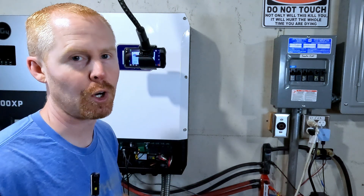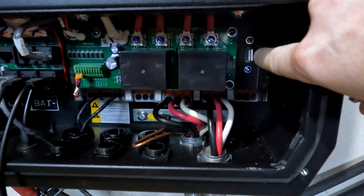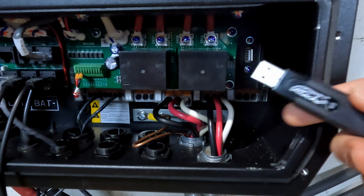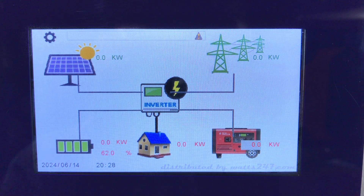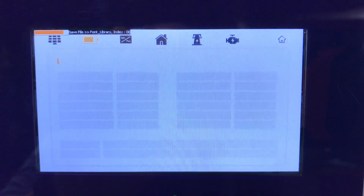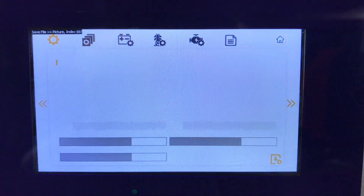Take the faceplate off the bottom. Where you need to plug in the thumb drive is all the way to the right — find your two big relays and it's just to the right of those. Plug your thumb drive in, and as soon as you plug it in your display is going to go blue. You might hear a beep, and then you'll start seeing images loading across the screen. If your screen goes black, beeps, and then comes back to the regular inverter screen, there's something about the thumb drive that the inverter does not like — try again or find a different thumb drive.